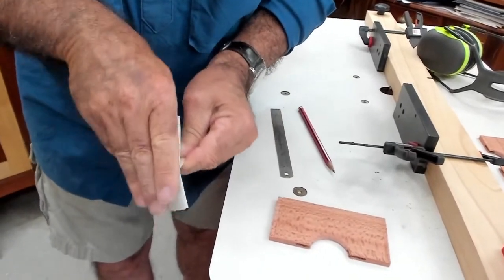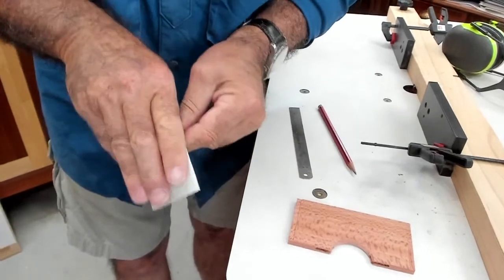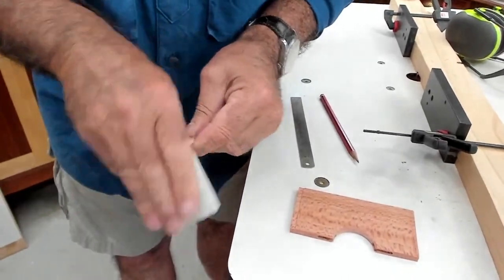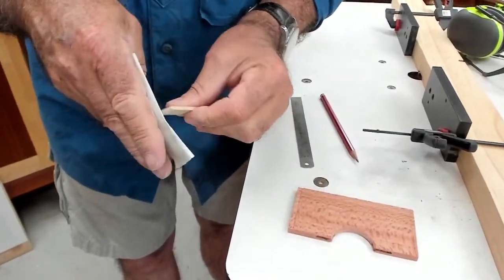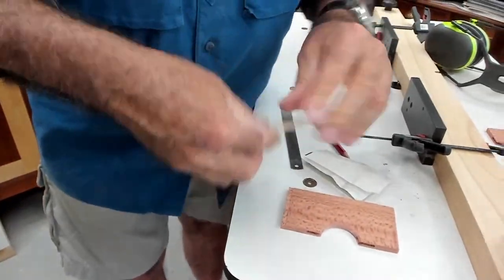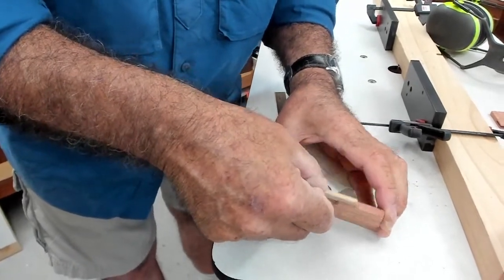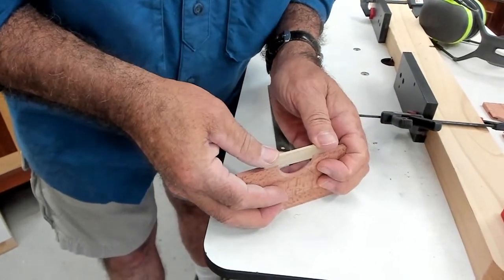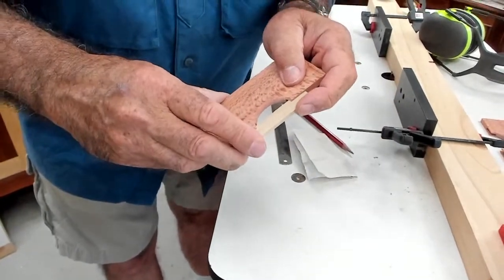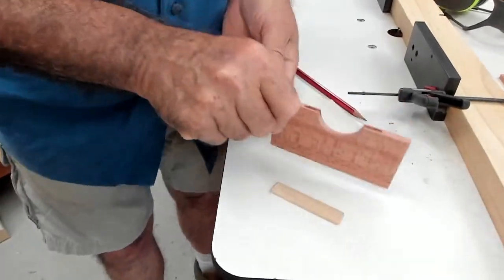Dave Rowlands was saying he's broken several of the very fine spiral bits by going a bit deep. TSRW 5 is the ones that Dave's broken. Yeah, I've spoken to him about them. Yeah, no, he was just making the comment that a few millimetres at a time is best, like go gently, because it's a very fine cutter.